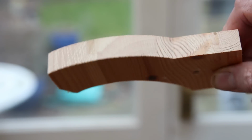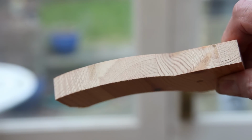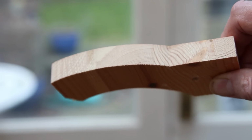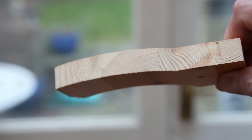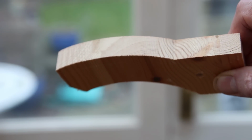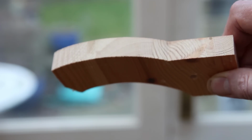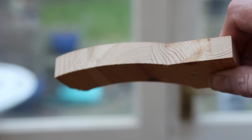While practicing prior to cutting out the trunnions proper, it became clear that the cut was pretty rough with the quarter-inch bandsaw blade, at least. Now, there's many possible causes, but undoubtedly this blade runs slow. So I decided to take out the 3-inch motor pulley that I'd started with and replace it with a 4-inch motor pulley and speed the bandsaw blade up from about 1500 feet per minute to about 2000 feet per minute. It can't do any harm.